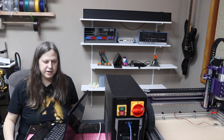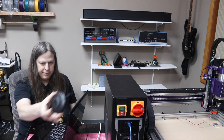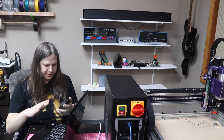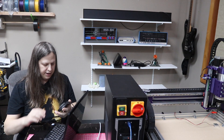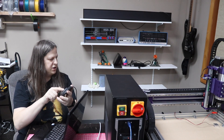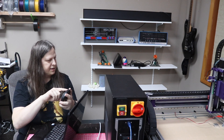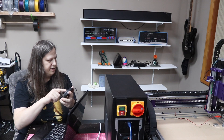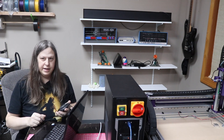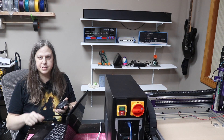I wanted to show you something pretty cool. While going through the settings of CNCJS I noticed something called Shuttle Express, and I happen to actually have one that I got for video editing but didn't end up using much. So I went through some documentation I found online and set up all the settings for CNCJS. Now I can use it as a jog wheel — I can select the Y axis and move it, then select the X axis and move that, and use the dial to select different jog distances. I'll link the setup instructions in the description.